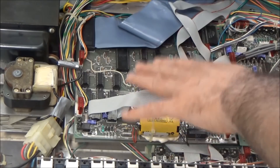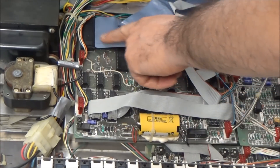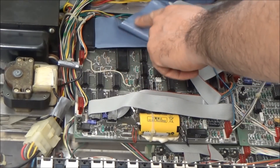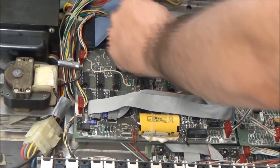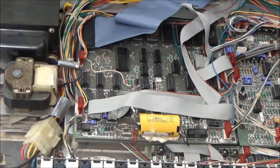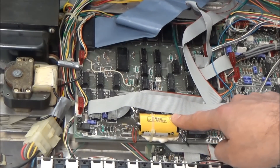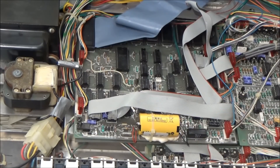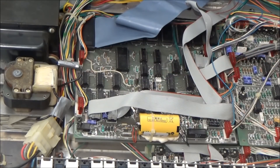Getting back on track, this digital board would normally have the Z80 CPU, but because this is the Memory Moog Plus, it breaks it out to another board, with a ribbon cable connecting it up to that MIDI board. There are some ROMs and some RAMs. The ROMs contain the firmware of the Memory Moog, instructing the CPU what to do. The RAM chips store the presets, and there's a battery backup here that keeps the RAMs powered when you switch off the synthesizer so you don't lose your presets. And then there's a bunch of other TTL chips that manage the CPU's address and data bus, so the CPU can communicate with the matrices of switches, LEDs, and pots.